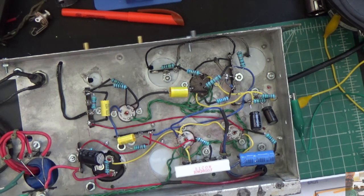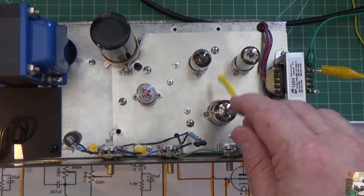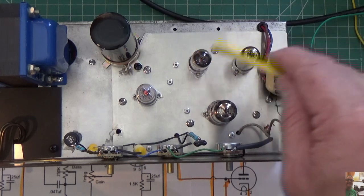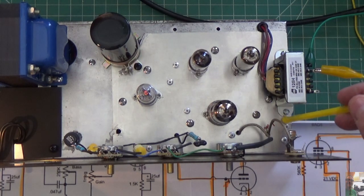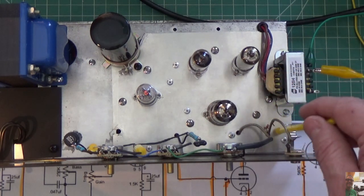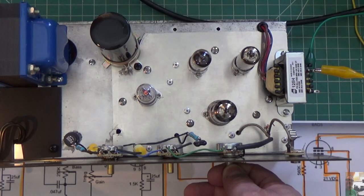Let me flip this around. I want to show you one other thing. Amp is still on. Here's my 12AX7 tube — nothing. If that tube was microphonic, you would hear it. This is my inverter, 6AV6. These are my two output tubes. The tubes are quiet. It's underneath. Now pay close attention right here. This is a piece of shielded wire that I have coming up from the bottom. That went to those two resistors that you heard. It goes right to the input jack. This entire wire is a large microphone. So is the input jack — coming through the speaker.